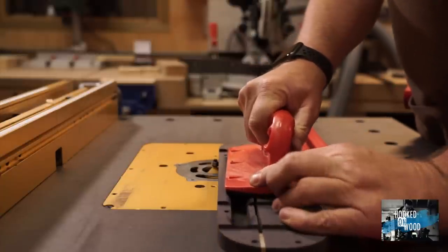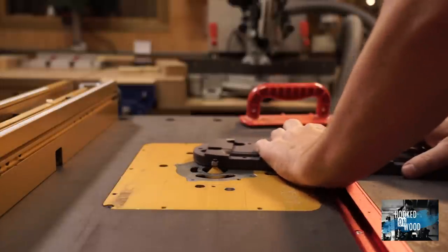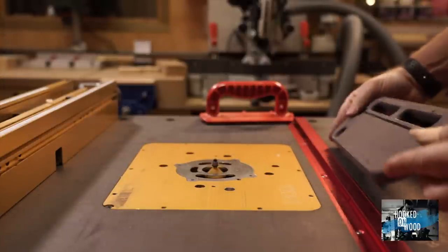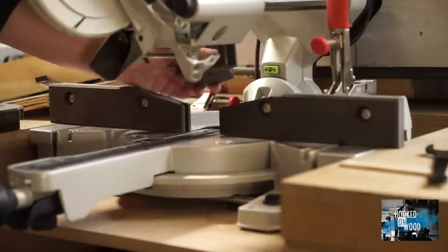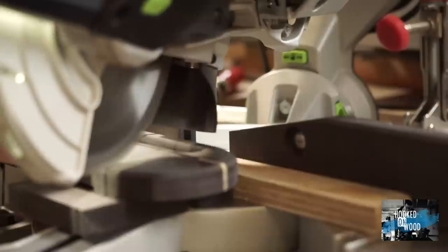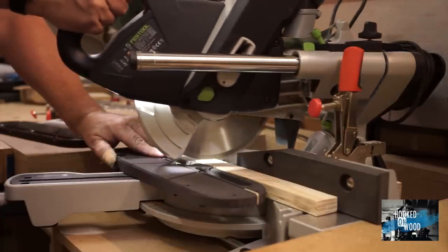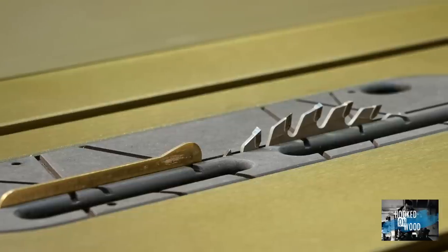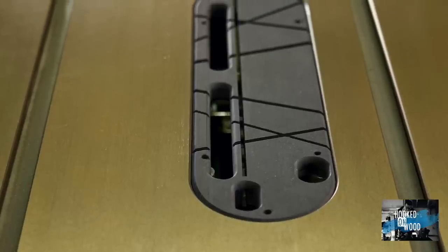We finish the edges with our router. Although it is not necessary, I do this for a reason besides that I like it from a design point of view. Last thing I do is making slots in the inserts. They are as deep as the bevel I put at the outside of the insert. These slots are not strictly necessary, but I think they help a little bit to release pressure when wood is gliding over the air inlets. I also like it from a design point of view — I like to make things a little bit different, and I think it makes this insert more interesting on its own.